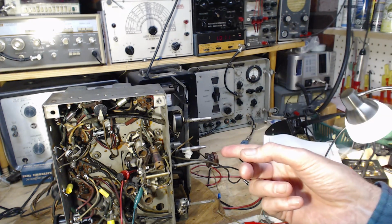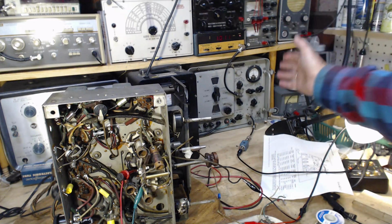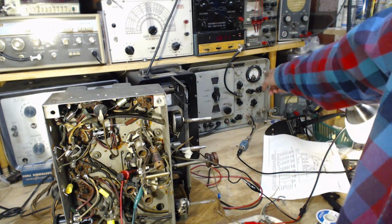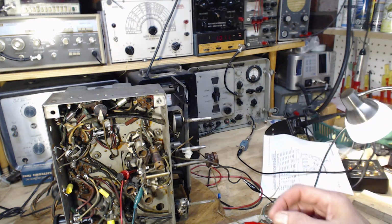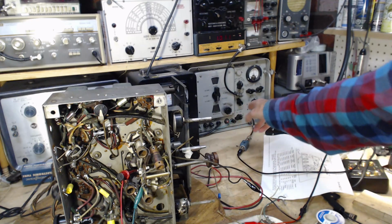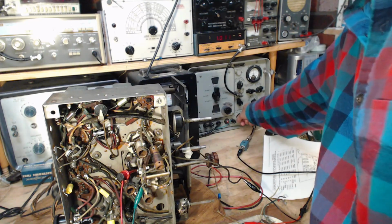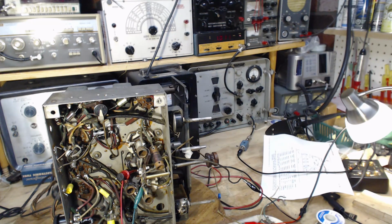We need to compare this now to what's happening with the shortwave band. So bearing in mind I've got this going at, let's see, 1000 times 10 is 10,000 microvolts on the antenna connection here. 10,000 microvolts. Really sensitive radios can pick up 0.1 microvolts and resolve it, except for the noise that would be there. So we're going to knock this down. 10,000, 1,000, 100. So it's 100 microvolts now. Switch this over.